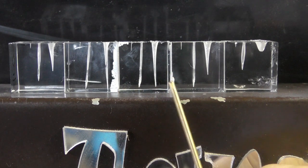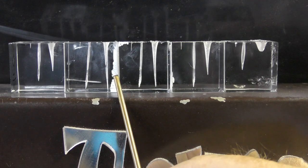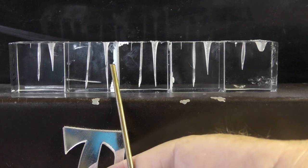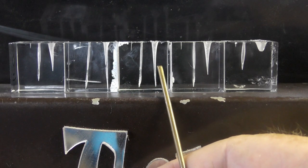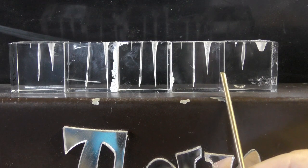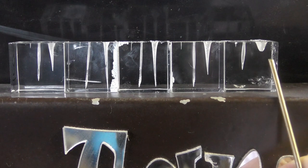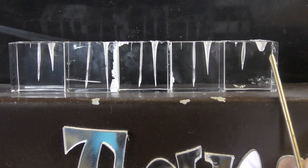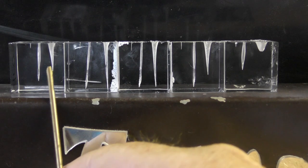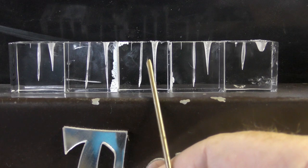So we might have three, four or five, five or six, four or five, and back to three millimeters penetration. Now let's look at the shape of our beams - this is a four-second mode burn without the lens in, and this reflects roughly the data from when I set up my beam. This is supposedly the best, most powerful beam, but it's interesting that at 700 millimeters it seems to have pierced through a little better - a sharper, thinner beam there than at 800 millimeters, where I thought my intensity focus was when I set the system up. At 900 millimeters, not particularly good. At 1200 millimeters, the serious real definition of a blunt beam.